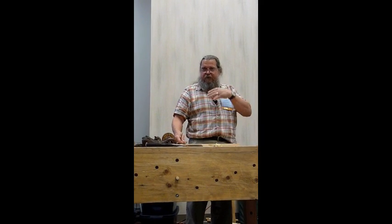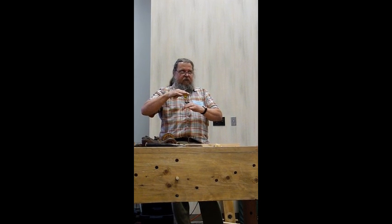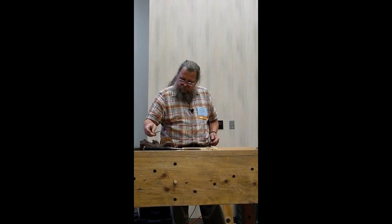So what you're doing with this process is you're building all these layers of accuracy. You do it one way, then you come back and do it another way and see if those points line up in the same point. You want to find out your mistakes in the layout. Once you got the layout and you trust your layout, then it's just sawing and chiseling. That's a whole other thing. But so there's the center line.